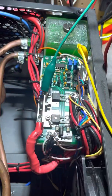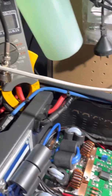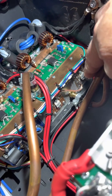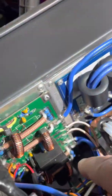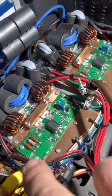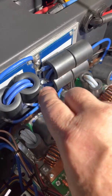So, well worth having. I was just connected up looking at it with the voltmeter and I was monitoring current, but that battery has died — I'm going to get another 9 volt battery. At the back the signal comes in, and down here is a 6 dB 100 watt attenuator going into a 6 dB 50 watt attenuator, and then that goes into a splitter. The signal came in through the PTTs and went down into the attenuators and then into the splitter. It comes out of the splitter and goes into the two amp boards right here on the side.